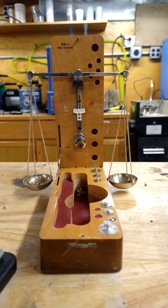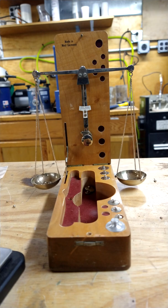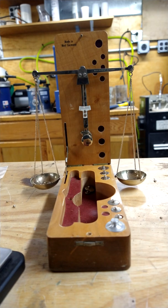On the right side of the scale are two American wheat pennies — they weigh four pennyweights total. I want to make four pennyweights of 14-karat white gold palladium-base alloy. I took my alloy mixture and threw in a little bit of palladium. The recipe will be posted in the description. The left side holds 58.5% — that's 999 fine gold, about 2.32 pennyweights — and the rest is the alloy mixture, totaling four pennyweights. We're using the digital scale and fine-tuning with the grain scale. This mixture is ready to pour into the ingot.